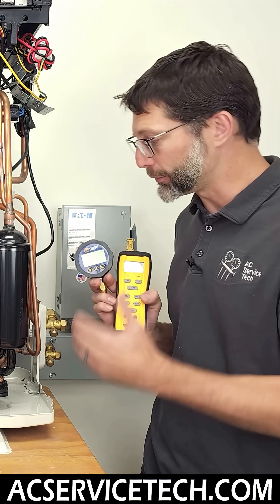In this case, you can see there's a larger accumulator tube, but you could accidentally overcharge this system just by trying to check the charge while the inverter system is running. So you're going to need to do any refrigerant adjustments with the power off, using the total weight method — using the cumulative line set length in order to determine how much refrigerant you're going to want to add into this system.